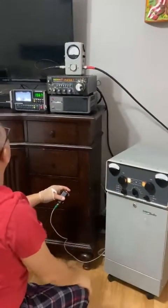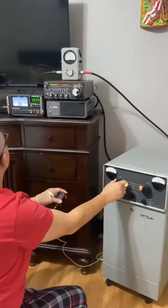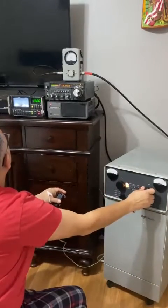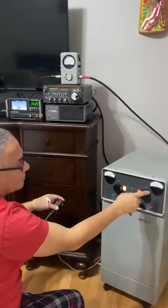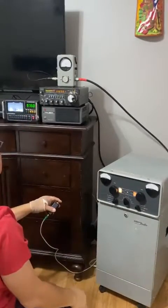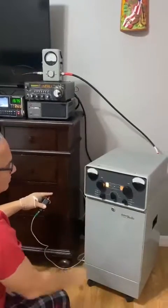It's already been tuned up. 1567 with the old tubes. Let's see if I can get a little more juice out of it. 1582 — and right below our limit on our plate current. So about 1552 is giving legal limit on the high scale.